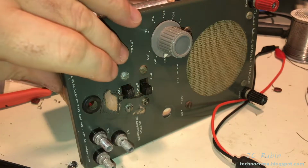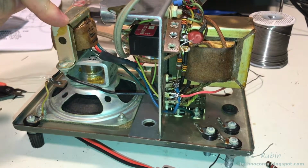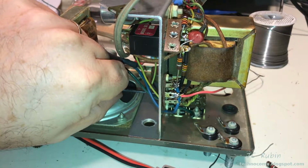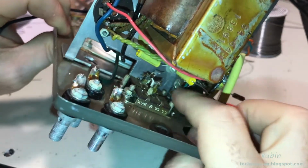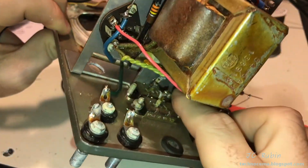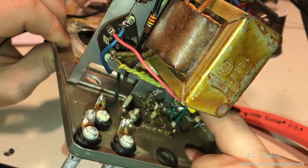Then we'll worry about the potentiometer. In a nutshell, this black wire right here coming off the audio transformer, this coil, this black wire grounded is what turns on the speaker. So I'm going to clip this off of there, and I'm going to find a suitable ground for it, and that'll be the end of it. The other side of that switch was the connection to the main star ground here. I simply clipped that off. The switch is now free of anything. It's just an open switch now, ready for whatever we want to connect to, and that will be main power.